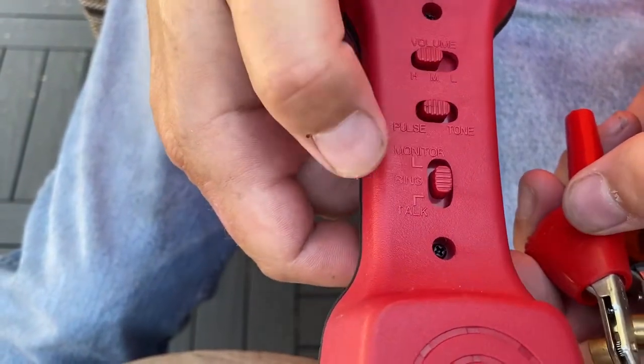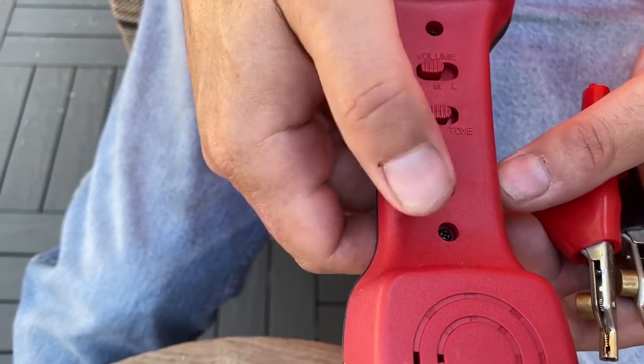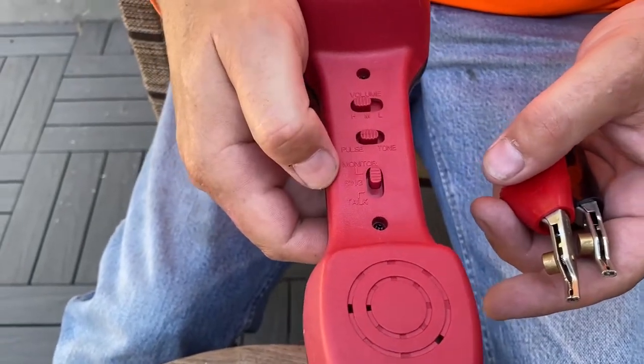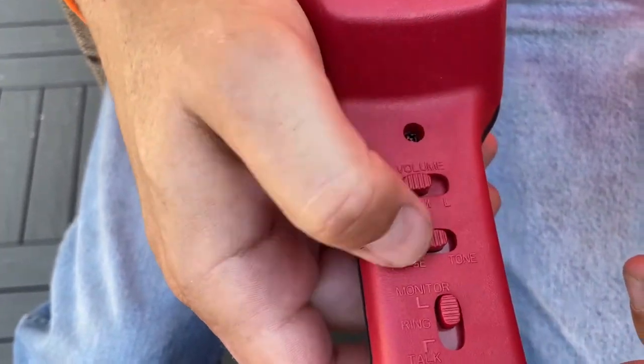In ring mode when hooked up, you won't hear the dial tone — you'll call into the number and it'll ring this set. You also have a monitor mode, which is like if there was a live telephone call and somebody was already on the phone and you didn't want to interrupt their call — you could still get into that call off of your leads. Also on dialing, it has pulse or tone.